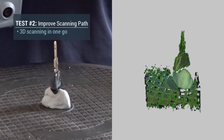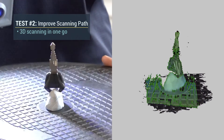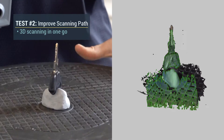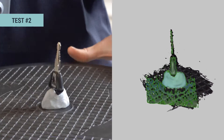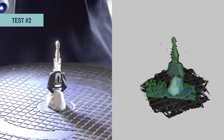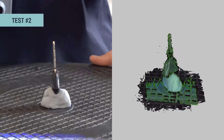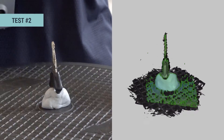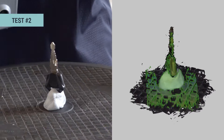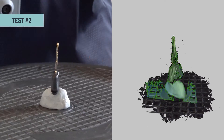It's important to know that more frames do not make a better scan — it's about quality, not quantity of the frames. This upright orientation also allows me to get a good angle and watch my distance with the scanner as I'm scanning these shiny parts of the key. We will take a look at the results in just a moment.